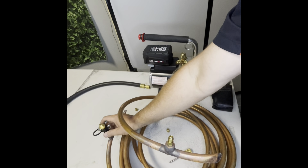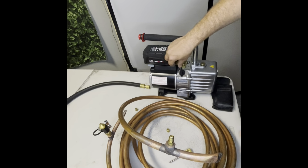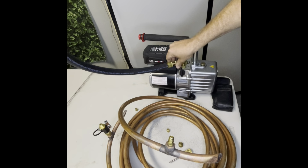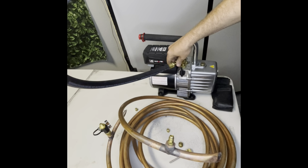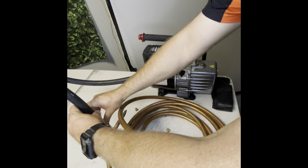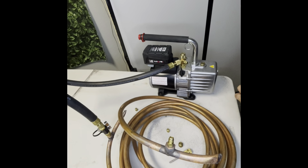and we would put either a micron gauge here, but I'm gonna put it on the furthest point away to do a true micron test on this. And I have a 1/2 inch hose with a 3/8 end and a 1/4 inch end, and that's what we're gonna pull through. Once again, I am not sponsored or affiliated with JB, but this is JB's 1/2 inch vacuum hose. All right. So we got that on there. Let's throw our micron gauge on here.